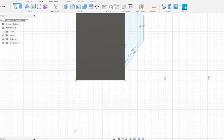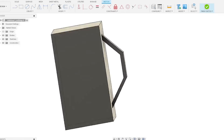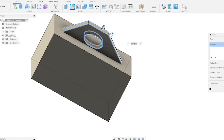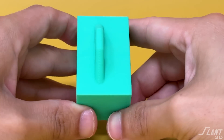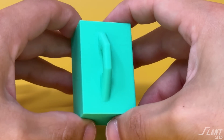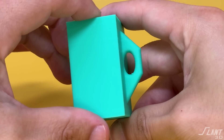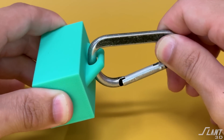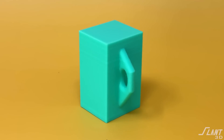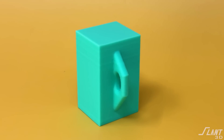The very first and simplest way of doing this is actually not to do a full loop, but just have a hole in a plate on the side. You can make an elliptic hole or perfectly round. Make the side loop plate as large as you possibly can to give it as much meat as possible, and then just punch a hole right through — for your zip tie, your cord, whatever it happens to be. This is a good simple way of modeling it up and gives you the material you need to make sure that this thing is reliable.